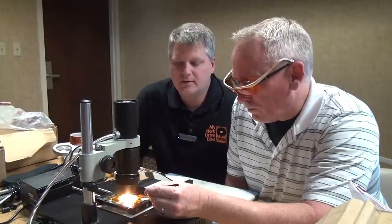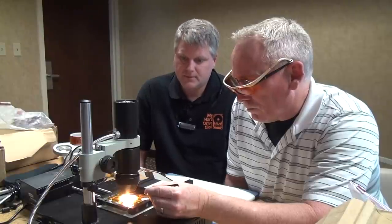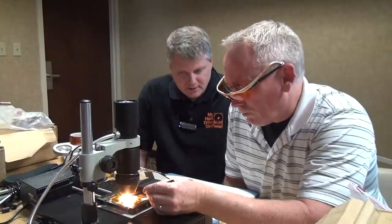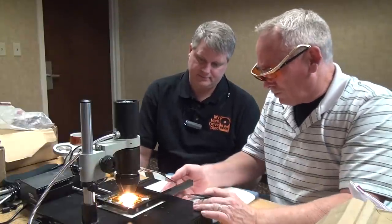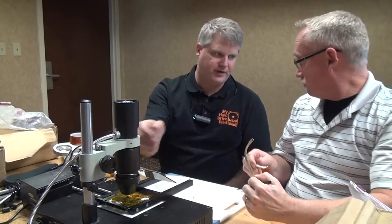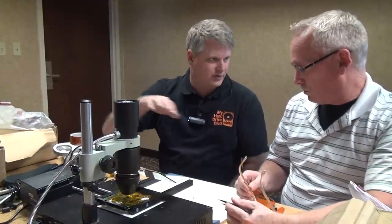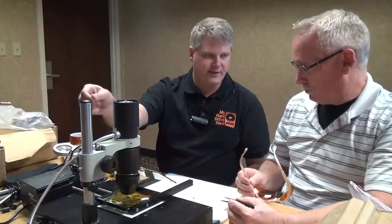I don't think it's quite there yet. Try and see if you can pick it up — if it doesn't move, don't try. There you go — pick it up, bring it out and put it down. Now turn the light off. This is the one that you saved from this board. Now you have another board — a good board — and you have a ROM on it, and you do the exact same thing. Put that ROM further away so that you know it doesn't go with it. I always do it in this order: I take the chip from the one I want first, then the second board is already ready to go, already warm, and I've already removed that chip from it.